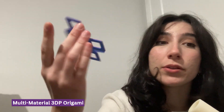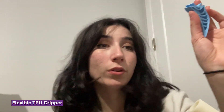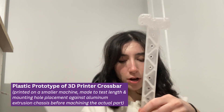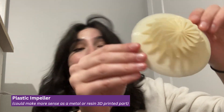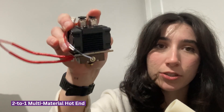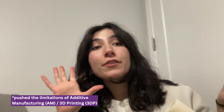I couldn't miss out on the classic BYU compliant mechanism by Stable Switch. I had some cool hybrid built origami, as well as a very chunky 3D printed mold and rubber stopper that I cast myself. Other cool parts included a flexi gripper, the cast version, and a mold I made from it. There was also a prototype crossbar we needed to machine out of aluminum for a printer build, made in three pieces — goes to show you can build big things on small printers. And there was a part that obviously makes more sense in metal, with really thin blades. Plus a bunch of guts from some printers I took apart, to show students the brains of a desktop additive machine — including an extruder with two going into one, and a stationary feed system where all the gears are visible. My booth basically explored the limitations of additive from different application perspectives.